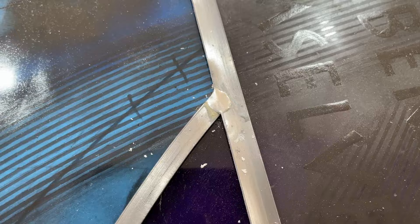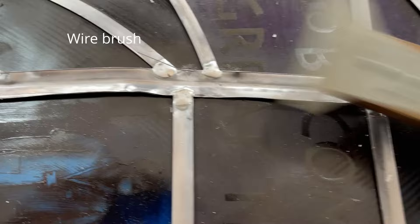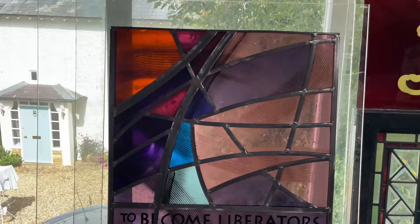What you want at the end of the day is nice flat solder joints. If you're using tallow candle flux, you'll need to wire-brush the joints afterward as there's residual fat left on them — that doesn't happen with paste flux. So there we have it: how to get great soldering results every time. Thanks for watching — leave comments and suggestions for future videos, join the channel, and I'll see you in the next video.